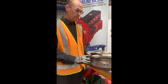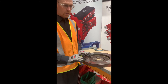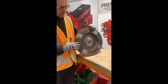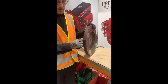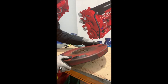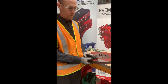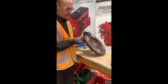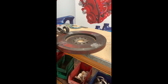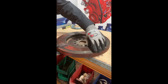The next step is to do a developer test using SKD-NF spray on the inside area looking at the welds, then put the vibration damper into an oven in an upside-down direction. When you warm up the vibration damper in the oven with the face down, if there's any leakage it will show up in a downward direction with gravity. Key areas to test are the join sealing capability and the two plug points, as well as around that weld area.